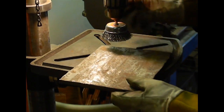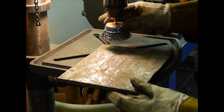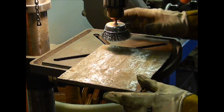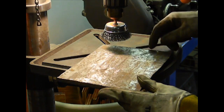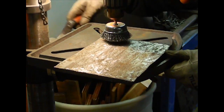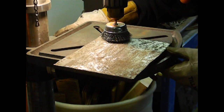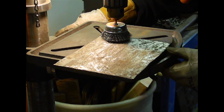So what I've gone ahead and done is buy a drill accessory. This is a wire wheel specifically meant to be mounted in a drill chuck, but instead of putting it in a hand drill, I'm using it in my drill press. To make this thing work, all I need to do is raise the table up into position until it touches, and once it touches, you want to give it just a hair more on the table rise.